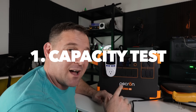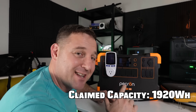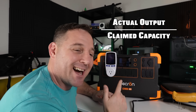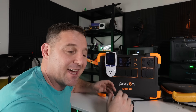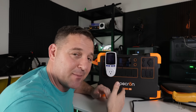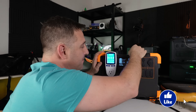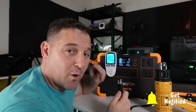For this test, I'll pull 400 watts, or about 0.2C of its nominal 1920 watt-hour capacity. The result will show how much power we got over its claimed capacity. The resulting percentage accounts for inverter efficiency and other safety features inside the power station. I'll reset my meter to make sure it's zeroed out and plug in my heat gun, which is set to pull around 400 watts.